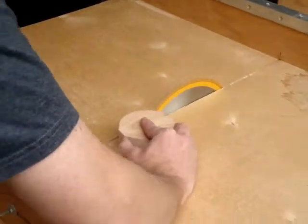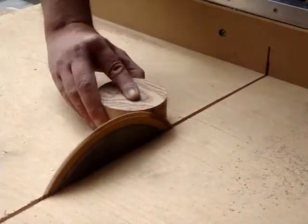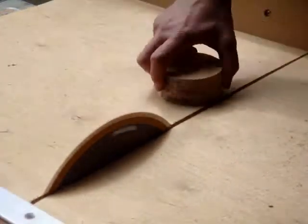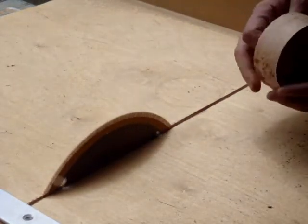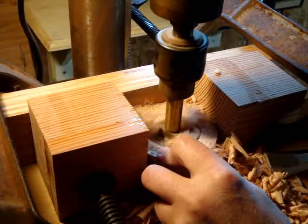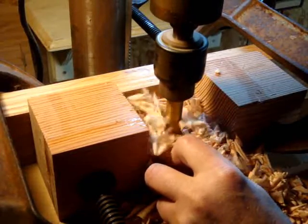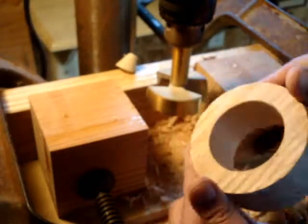Things do funny — see this? So I've got to tell you, it makes pretty decent circles. I'm just using my drill press with a 2⅛ inch Forstner bit to drill out holes in the center of those circles. And now I've got a perfect little circle.